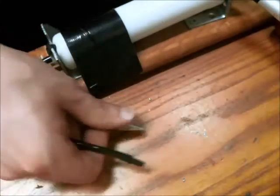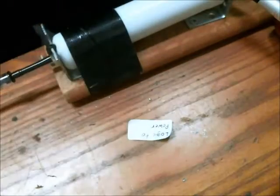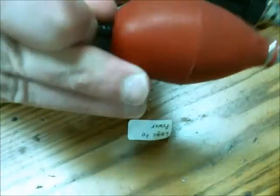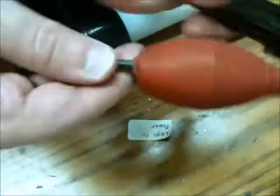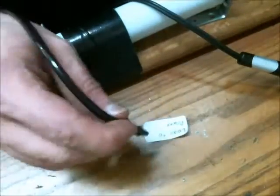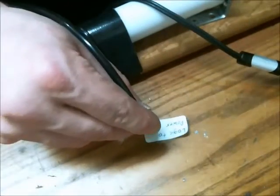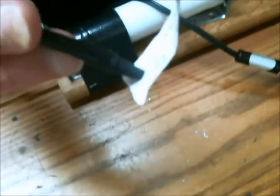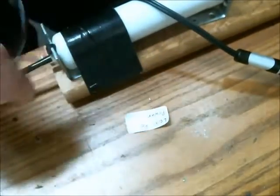And just to demonstrate the vacuum action of the pump, I'll use the input valve, which typically gets put into the solder sucker here — like so. And I'll use it to lift this sticky note. It can lift little lead balls as well, but this is easier to see. So you can see it's holding that quite well, and when it stops, it releases.